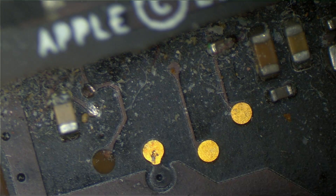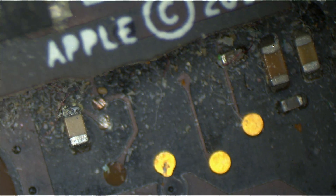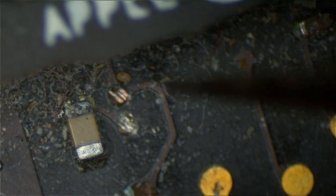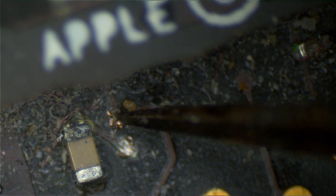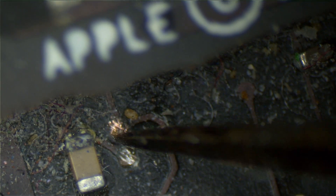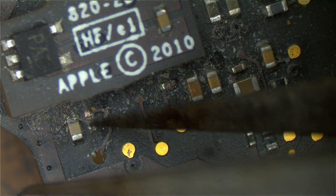What I'm going to do is scrape away the corrosion, because you may think there's no pad there and that you can't solder to it. But as soon as you start scraping, you'll notice there actually is a pad there and there isn't any serious problem. You can just scrape away the corrosion, then go over it with flux and solder. As for pad repair kits — those are really for bigger devices, not for 0201 resistors. When we're doing pad repair on 0201 devices, it's just not practical.